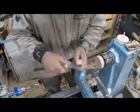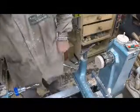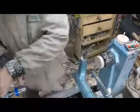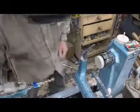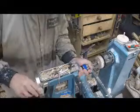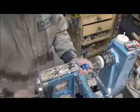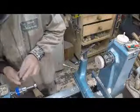This is roughly 1 inch. So if I go 7/8, that should probably give me a little extra room. And like I say, this is my prototype, so if it doesn't work, I can figure it out next time. Turn the speed down. Yeah, I'd like to go in probably that far, length of the bit. That leaves a little bit on the bottom, so that on the bottom all you see is the 3/8 hole. That's roughly a 1/2 inch deep. That should be more than adequate.